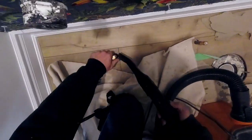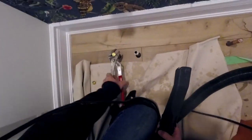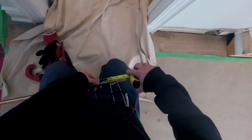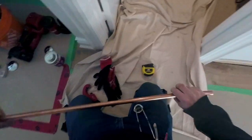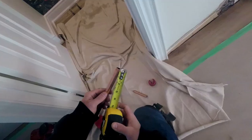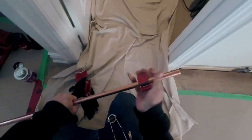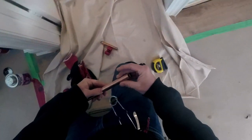So peeps, I start this job off by shutting the water to the house and shop vacuuming all of it out. These pipes I'm opening here are the lowest point of access. There's nowhere lower in the house that I can drain it from. So when I open up these caps, I will literally be getting all the water between the second floor and the main level. Having a shop vac is really important. In vlog 123, we also noticed that this house takes a long time to drain, so the shop vac speeds up the process for us.